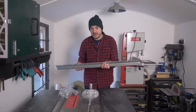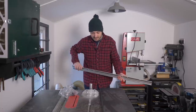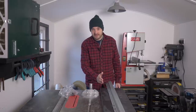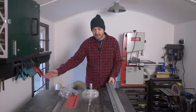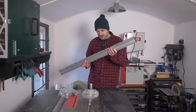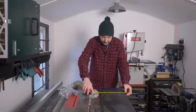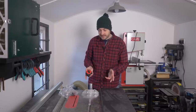The extension wing also comes with a new fence rail that goes the whole length, including a tape measure. I never really felt I wished my fence would move to the left of the blade — it's not something I ever do. So I wasn't fussed about that, but what I would like is extra rip capacity to the right. I was thinking maybe I could re-drill and cut the mounting holes, put this on the right, move the fence over, and gain an extra 25 centimetres of rip capacity. Let's see if we can get this fitted.